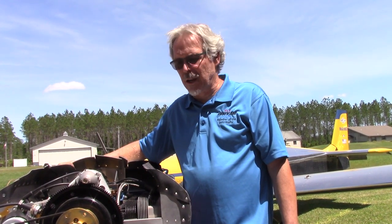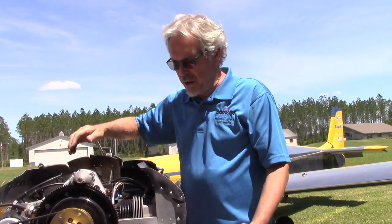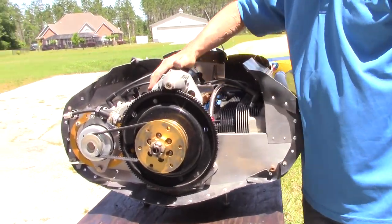It's likely to get a whole new crankshaft — about a thousand dollars, and that's probably the appropriate thing to do. There's a lot of good stuff here but also some messed-up details. This engine was finished in late 2019, yet it exhibits characteristics telling me the builder wasn't paying attention to updates. There's a device here to drive a tachometer — the actual piece we use is smaller than a AAA flashlight battery. This is a colossal piece with a giant steel nut. That is an anti-lock brake sensor, and this is a ridiculous piece to have on an airplane.